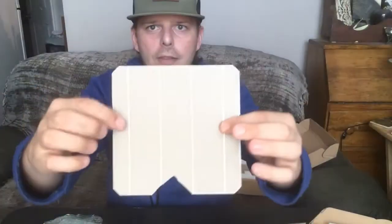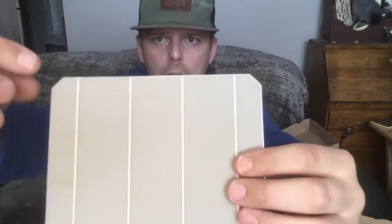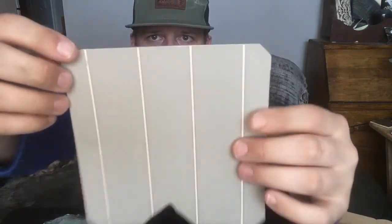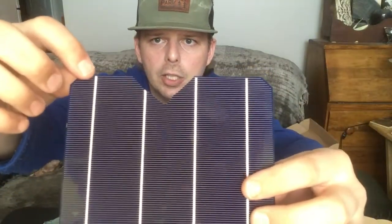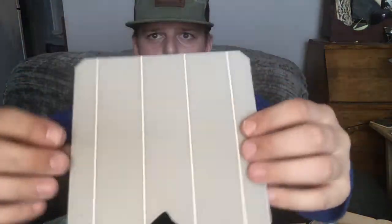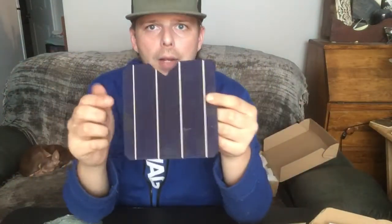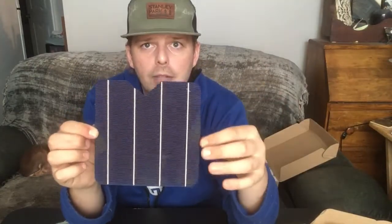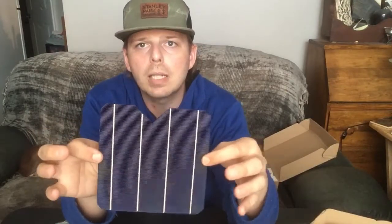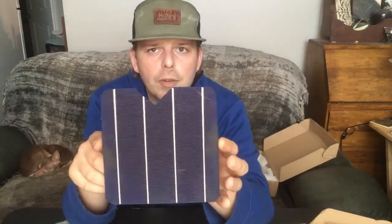This strip here is your negative, and when you flip it over, that strip is your positive. You have to run a lead from each cell to the next — I would run a lead from the positive and solder it onto just that little edge to the next panel, and so on down the line. You do all four leads. As you're doing this, you'll obviously need UV protective glass in front of the cells — there are a couple of different materials you can use for shielding.